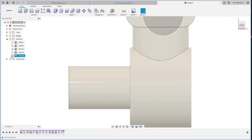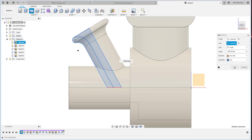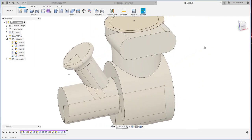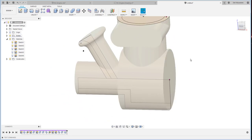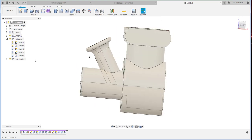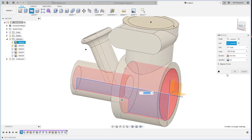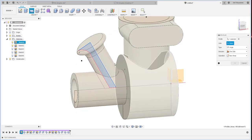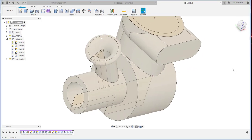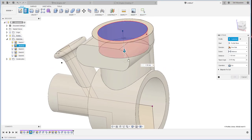Okay, mini sketch, just open up the sketch and then we do the revolve, this one, and then do all, make sure it's joined. Okay, it's finished. And then we want to make the, okay, I think the outer part, the whole body, is finished. Now we have to make an inside hole. Okay, that one is finished, and then we also rotate this one, the axis is this one, and then the cut. Okay, it's finished as well. And then this one I extrude to the bottom.